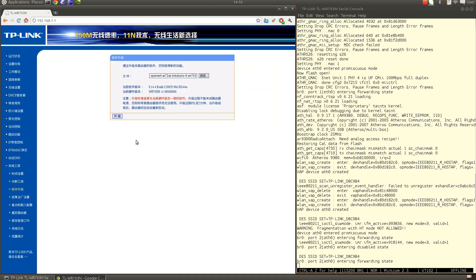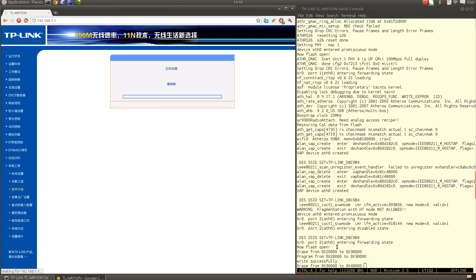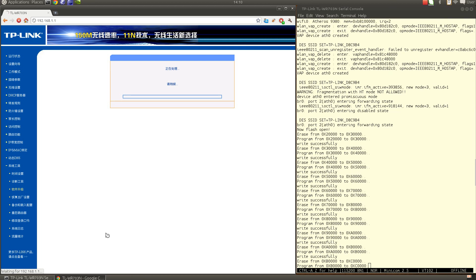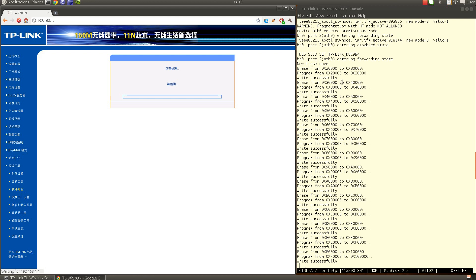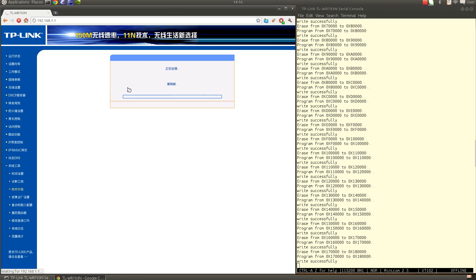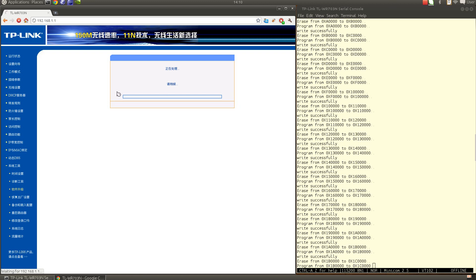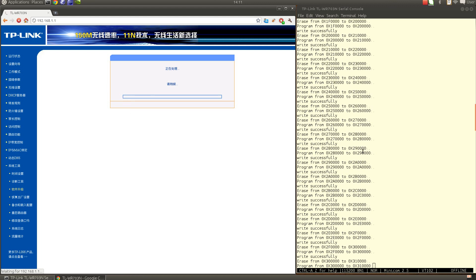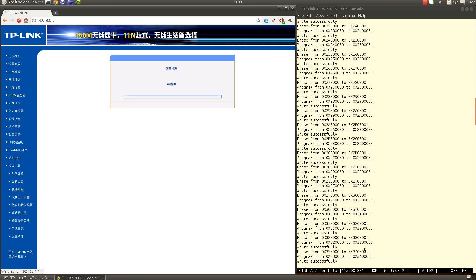Press the bottom-left button to confirm. It will upload the file — that's pretty fast — then verify checksums and start flashing. It's safe to do this over wireless since the file is fully sent and verified before flashing begins. One strange thing: the progress bar doesn't move during the flash, so if you don't have a serial console you won't see any activity. You just have to wait.